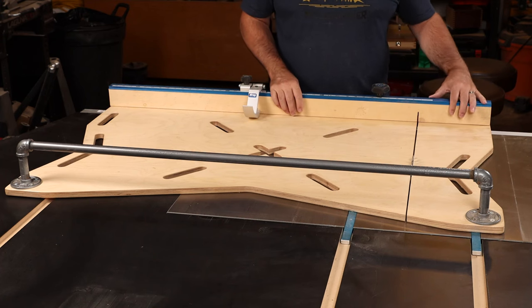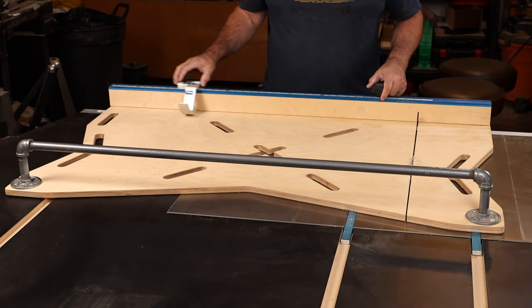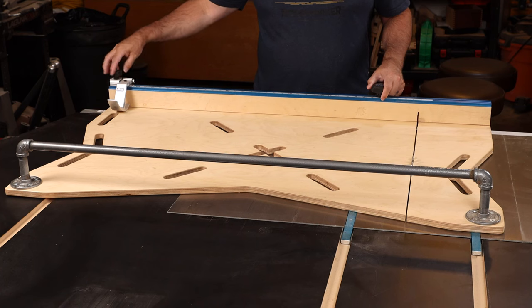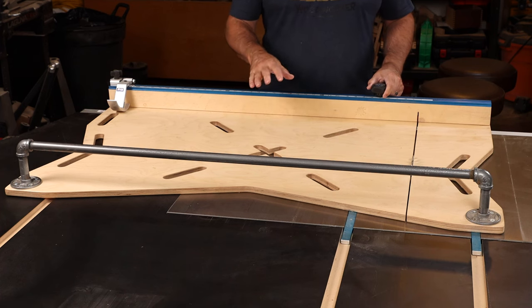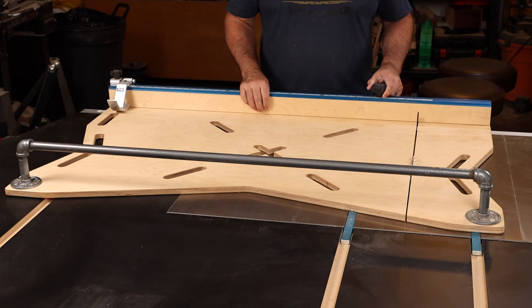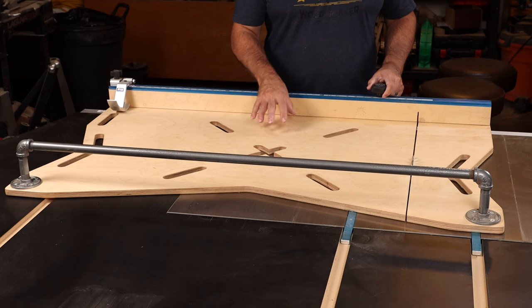This particular sled uses aluminum miter bars from Kreg. The capacity of this sled is a little bigger — I can get 37 inches of maximum cut length, which is huge. Anytime I'm cutting a furniture part with a crosscut sled and don't have to go over to the chop saw, that's a big advantage. I think I get better cut quality here and usually prefer to do my finished crosscutting with a sled. The advantages of a two-rail sled include supporting your offcut, accommodating longer workpieces, and handling wide sheet good cuts for things like cabinets.